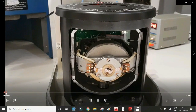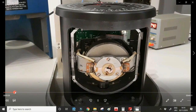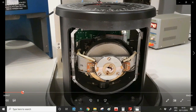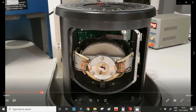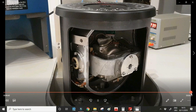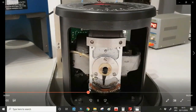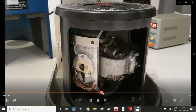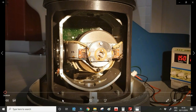The unit has started. In this instance the gyro flywheel spin axis is facing west of north. You'll see the y-axis start to rise and find its level, then initially it starts turning counterclockwise very slightly before moving clockwise to find its north position. You'll notice it overshoots slightly and has to come back. This process took approximately 46 minutes. If you scrub back and forth quickly you can see how the y-axis hardly seems to move.